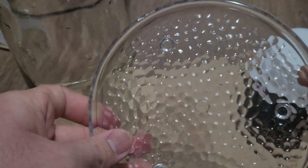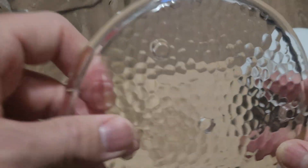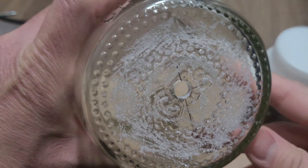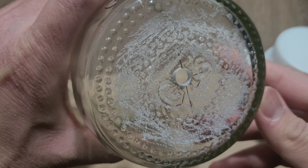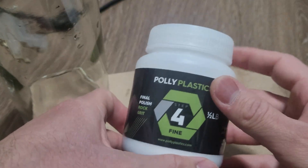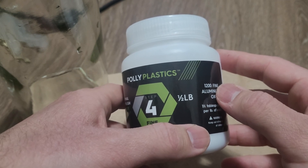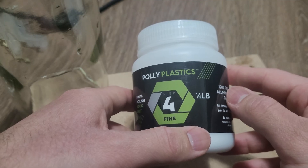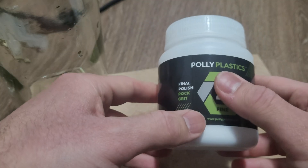This is what it looks like. I've also roughened up the surface of the bottom of the plasma tube so that the epoxy will stick better to it. I'm also going to be adding aluminum oxide to the epoxy — this improves the dielectric strength and the thermal conductivity of epoxy. I did a bunch of tests in another video, which I'll list in the description — you can also check that out.